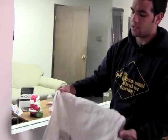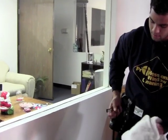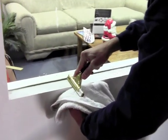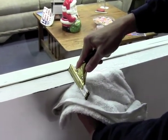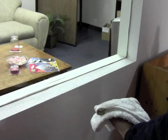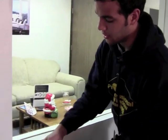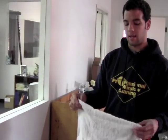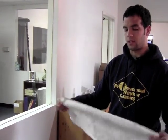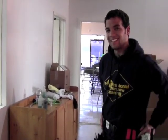But if I was doing commercial and it's just a small metal frame, I'll take my little brass squeegee and I will squeegee the ledge, and I will towel at the same time. I'll tilt the squeegee when I get to the end and push all the water under my towel. That looks pretty neat because you're toweling and squeegeeing the ledge at the same time — it saves time and it doesn't make your towels all wet when you're constantly using them to pick up water. And that's a little bit how I do window cleaning. Thank you.